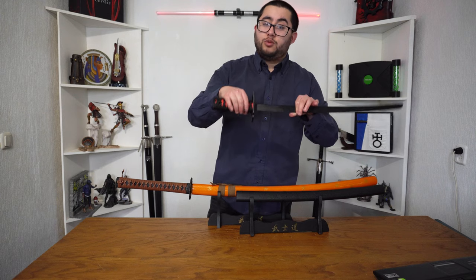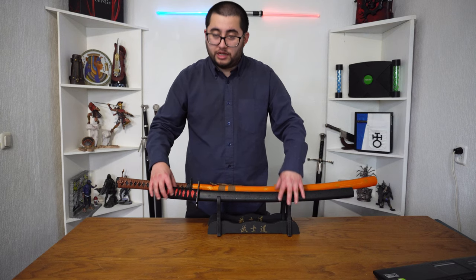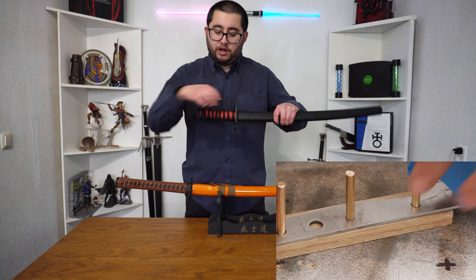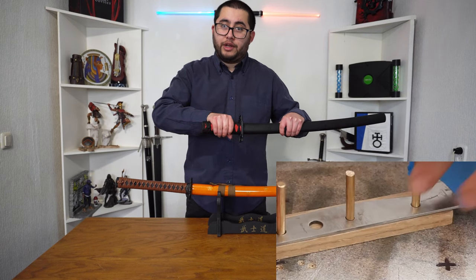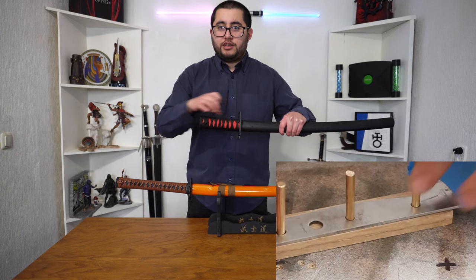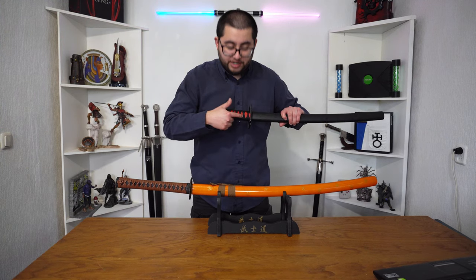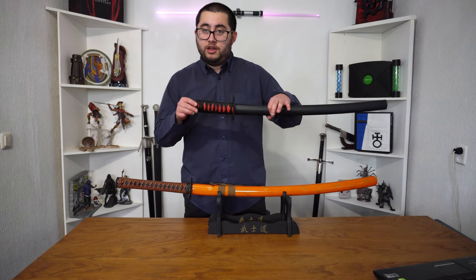That's why it broke so easily. The way I repaired this katana is by using the same technique used in kitchen knives — I'll put up a picture of a kitchen knife. Basically what you do is drill through the back side of the blade where you want the handle, put wood around it, then put metal pins through the wood and the blade, glue it all together, and grind it so you get a nice clean smooth handle. Then obviously you've got the traditional wrappings of a katana, which I didn't do too good a job of but looks all right in my opinion.